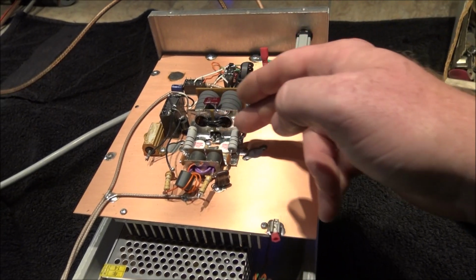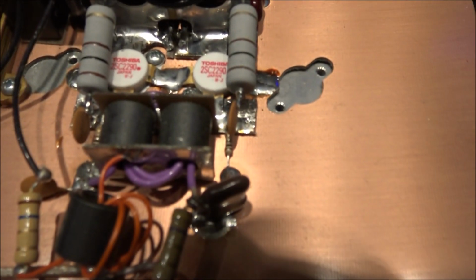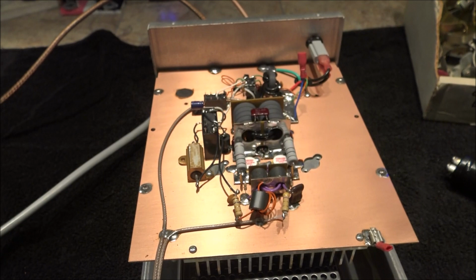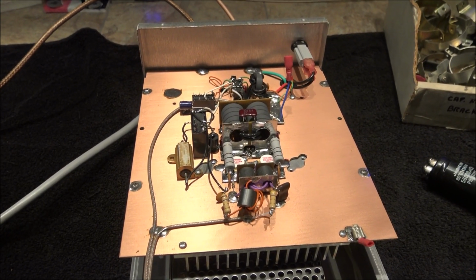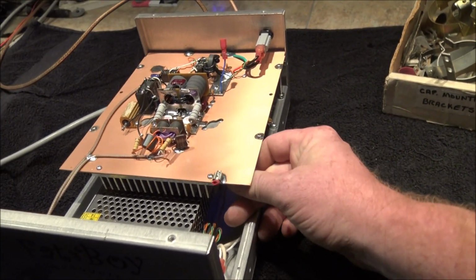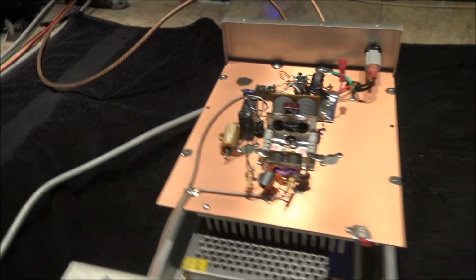But we've changed out your output transformer, changed out the flyback resistors, we changed out the transistors. They're now Toshiba 2290s. Each transistor is getting fed with its own piece of 12 gauge Teflon wire. Just shooting right along, my old friend. Anyhow, when I'm back, this thing will be all in one piece. I wanted to show you this before we got any further, and let you see what I had going on. So we'll be back.